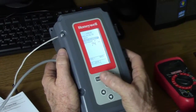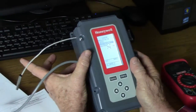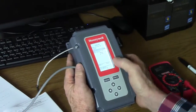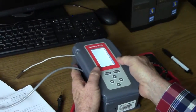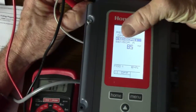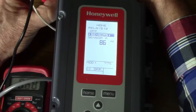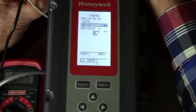We're going to simulate a modulating output by holding the sensor. Because we're set up in cooling, as our temperature rises, we're going to see this modulating output rise as well. We can track that both on the screen as well as with my meter here — these should be about the same. My output should equal my modulating display as well as my meter. We want to see this rise to 100% as we get through our throttling range and up to 90 degrees.